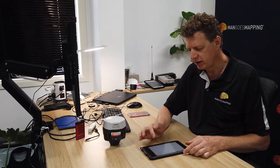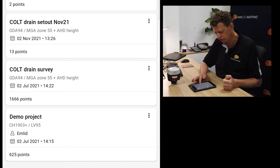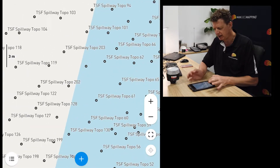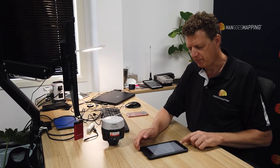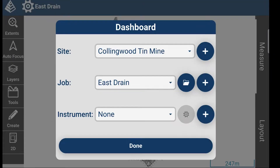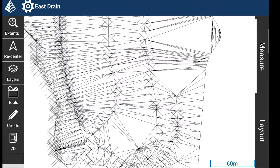It's very powerful. We can connect to our receiver and load up jobs — if I select a job here that's got a decent amount of data, this one's got sixteen hundred points in it. You can see it's loading and moving around that job very easily, with no problems with screen redraw or lag. It works well with Carlson Layout too, making it a wonderful platform to pair with your Emlid RS2 hardware. And again, it's quite responsive.